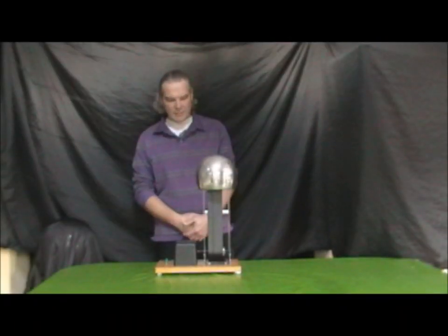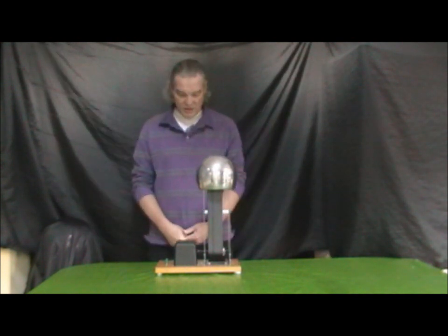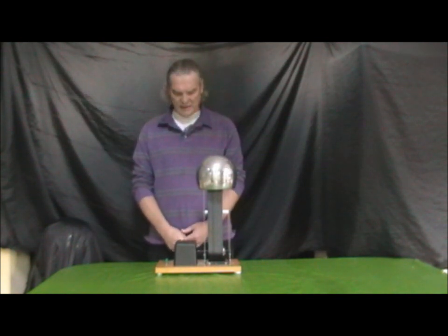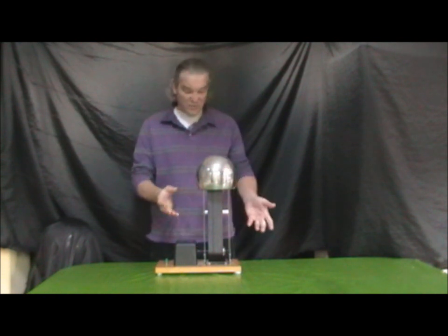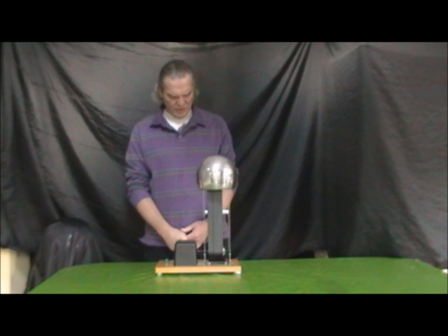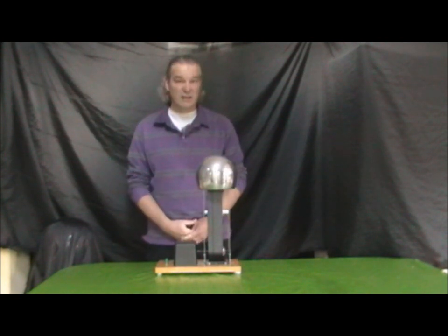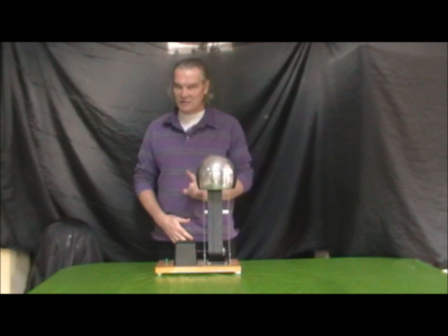Firstly, a little bit about this one. It has got a few design flaws, I have to admit. The electric motor that drives it is in here. You don't need an electric motor, and they could have used a better one than they did on this, because it looks like it came off a model boat. There's a transformer and a rectifier in there to turn it into DC. It drives through a little plastic piece that does have a tendency to slip. The belt is open, as you can see, which is a brilliant way of picking up all sorts of muck. The pulleys are at least ball bearing, but the axles they drive on are rather curious. And the combs are made of bits of metal that have got lots of little holes in them — but it does at least work, and hopefully I'll be able to show you one of its major design faults.